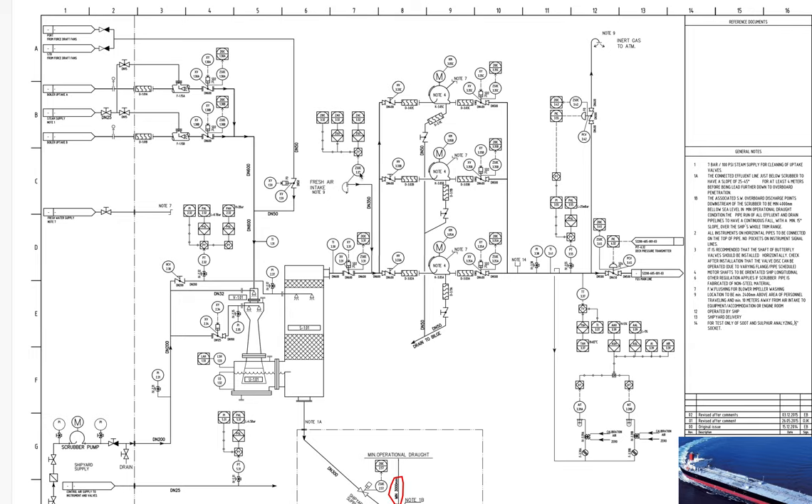You can use two or three fans depending on your kilowatt consumption for suctioning fresh air. When suctioning fresh air, there are limit switches — when the cover is activated, it sends a signal to the PLC. You will see on the monitor that the door is open, and then you can start your system and operate all these blowers in free gas operation from the operating panel. If the system is not ready, it will not start — this is a kind of interlock that must be satisfied.